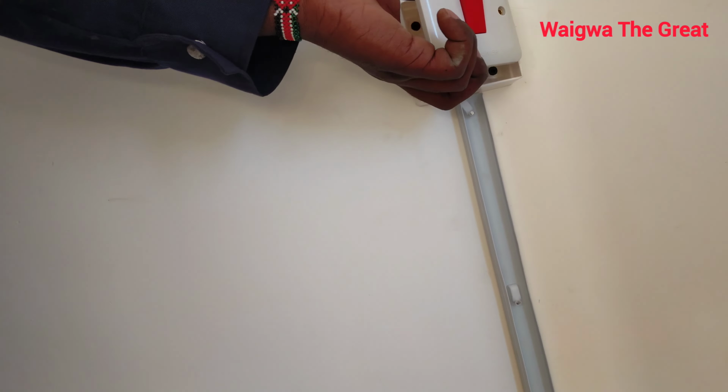There are 30 of them. So these are our system. Let me show you where our hot water leaves the system. This is the hot water outlet, as you can see, and this is the sensor hole. I'm yet to bring the sensor. It's over there. I've already done the cable. I'm left with doing the piping and the electrical part, bringing the pipes over here, so that we can put the sensor. Here our controller will be telling us the temperature of the water.